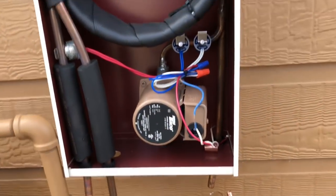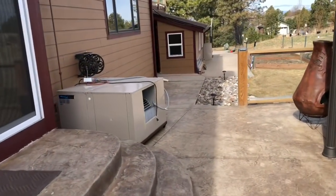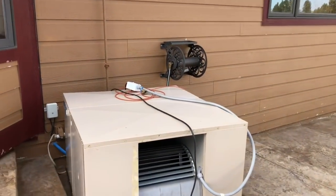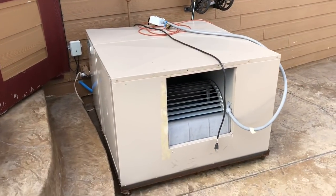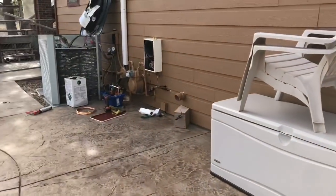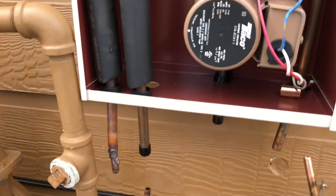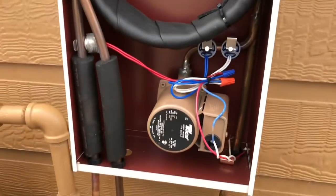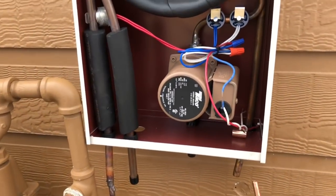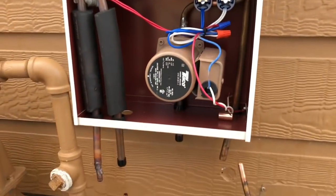In this case I'm going to pump that water through a swamp cooler. Warm — probably even hot — water will come out and evaporate quickly, giving me 60-degree water out the bottom to feed into the house. However, I have concerns about this type of heat exchanger being outside: it has freeze stats and will circulate water, but that's just a waste of energy, so I really don't want this on the outside of the house.